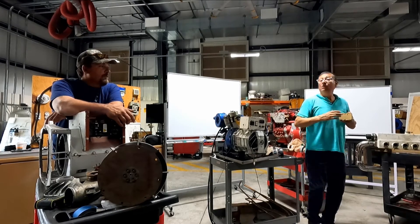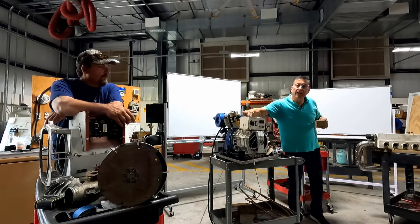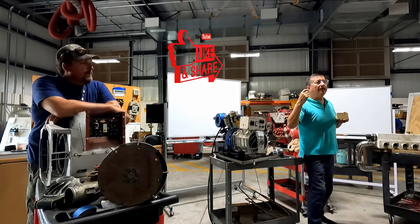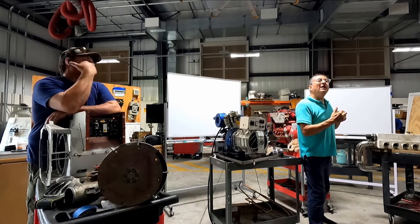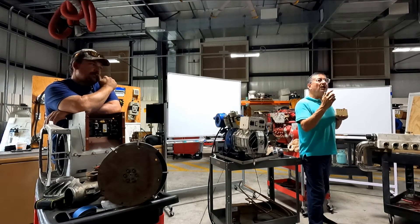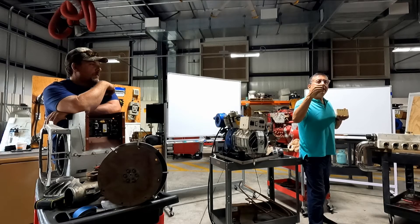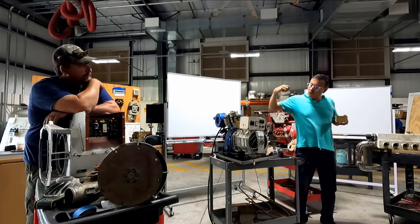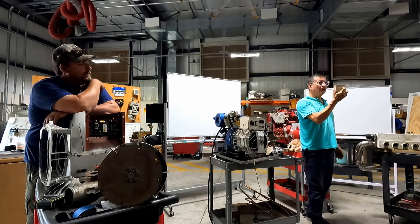To calibrate gain, turn everything off, then with the generator running, connect your voltmeter. Have another person assist you - ask them to apply air condition number one while you move the gain pot a little clockwise. Check the response. Apply air condition number two. Adjust further as needed, then apply full load and verify if the response is good with the gain pot.